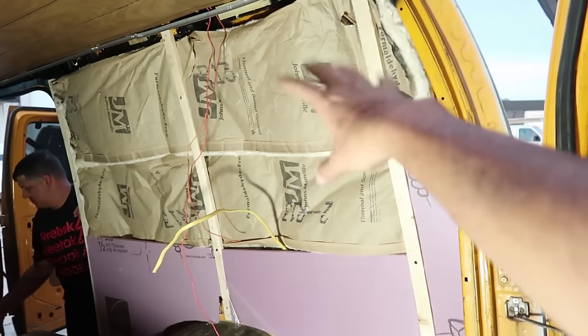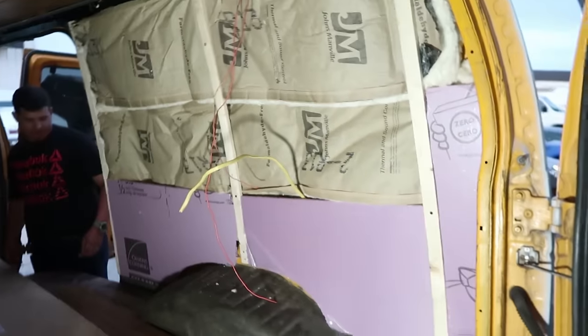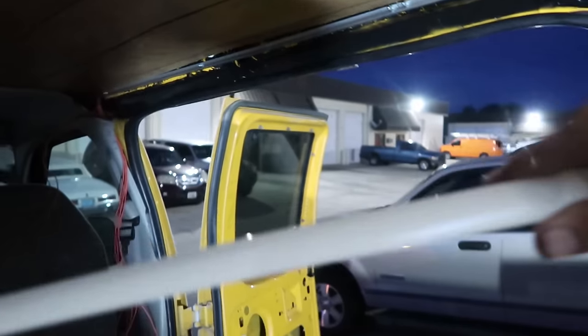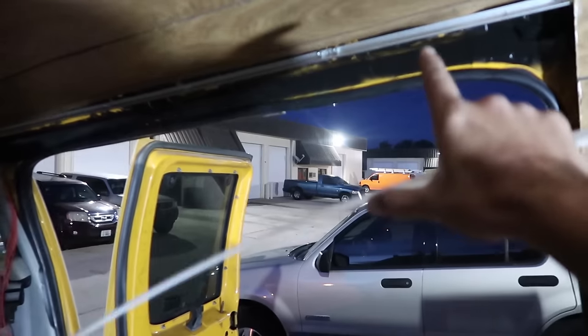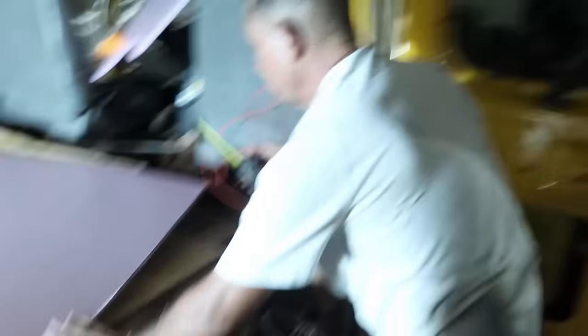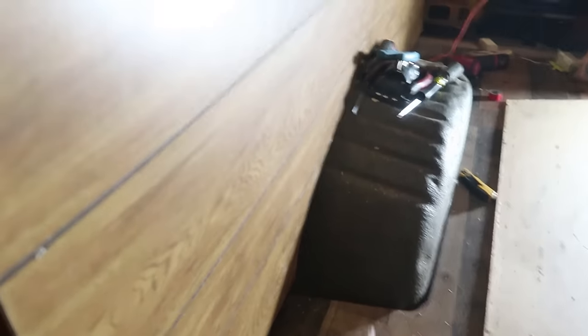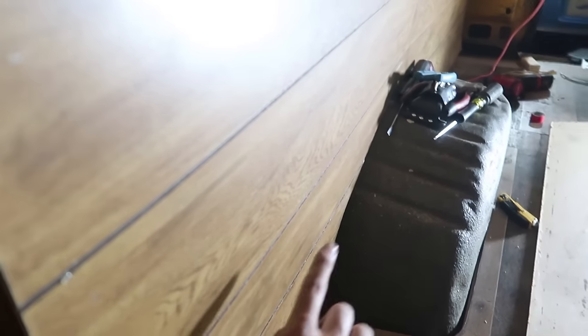This is how we're doing the walls: R13 on top, which is a lot fatter, then foam underneath where it's closer to the wood — that way it fits perfectly and it's going to be better insulation from top to bottom. The RGB strip comes with a light diffuser that's supposed to click in, but I knew it was never going to click perfectly. You just literally lay it in between the roof panels — it doesn't need to be clicked in, nothing needs to hold that — and it looks great. It's going to be lit up with RGB. Me and my dad are cutting the bottom foam. Angel is over here working on getting the wiring done on this wall. The wheel well we're going to cover with more wall material, making a little L bracket in the corner to make it more square.